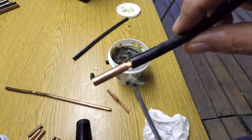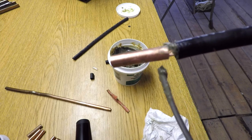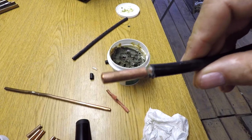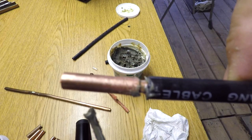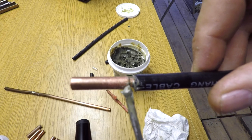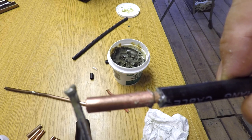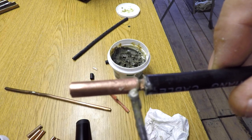I like to take plenty of flux and run it. See how I don't have it pushed on all the way? I've got a little gap there — I'm just going to run some flux right there. This is just how I like to do it. Then what I'll do is heat this up on the end — that heat will transfer to the inner wire. Now this sheathing is going to burn back a little bit, but that's fine. Then I'm going to touch my solder right here and it'll suck the solder up inside. Then I'm going to push that on before it cools, all the way on. This just helps me make sure the solder is being sucked up inside the joint.